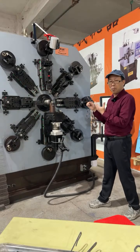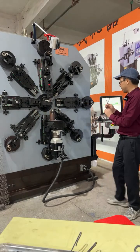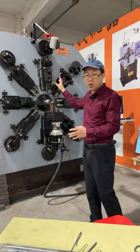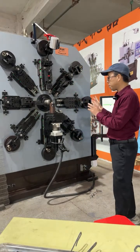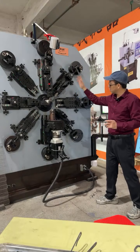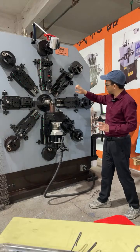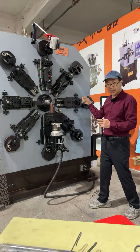At a rate of about 9 to 12 pieces per minute. The whole machine includes wire feeding and wire decoil, then goes to the main machine, the chamber including the wire rotary and the wire feeding. Then it goes to the work panel, with the wire feeding tools and the forming tools. Here is the forming side. You can see presently it's running with just 5 sliders involved, 5 sliders join this task.